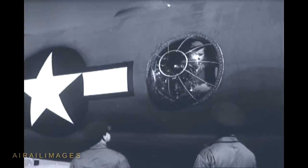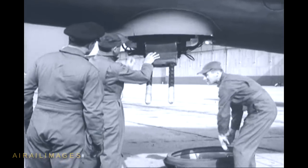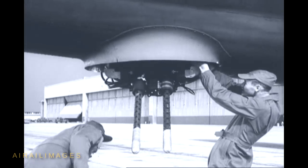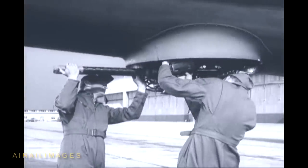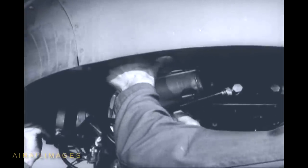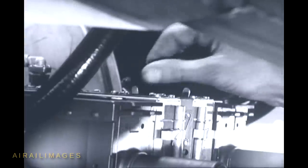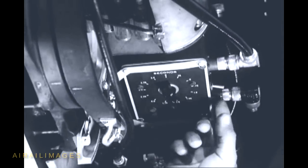The pilot and co-pilot continue their tour around the plane — they have a lot to check: hatches, windows, control surfaces, trim tabs, inspection plates and doors. The gunners, besides helping the pilot check the airplane, must also be sure the guns and gun cameras will work properly. They must inspect all five turrets. After they have the dome and gun cover removed, they see that the ammunition moves freely in the chutes and is correctly loaded — the guns just don't fire with the cartridges in backwards. They also check the safety wiring on the gun mounting bolts, then the gun charging switches are put on reset, which conserves the CO2 pressure that automatically charges the guns. Finally, the gun camera is inspected: enough film, speed set at 16 frames per second, lens adjusted to the brightness of the day, and the interval control put at the desired number of seconds and turned on.